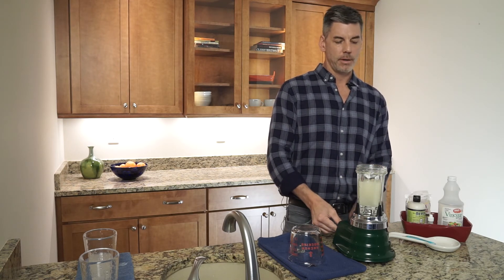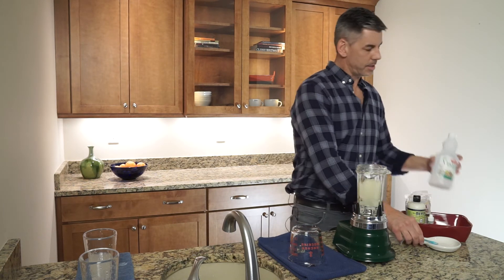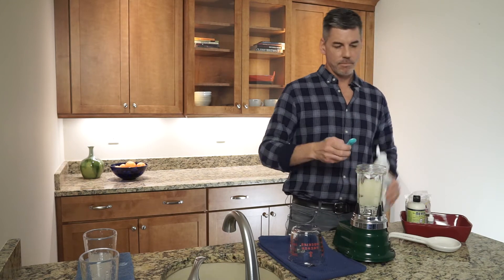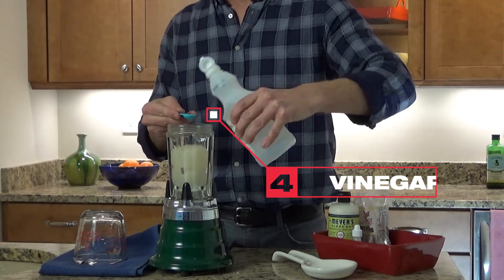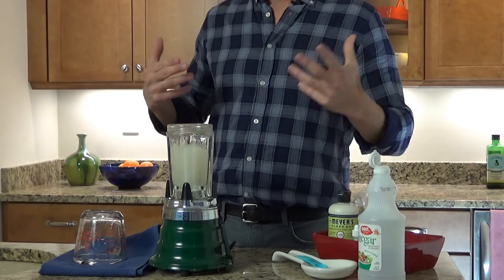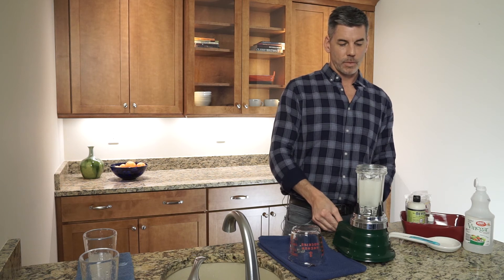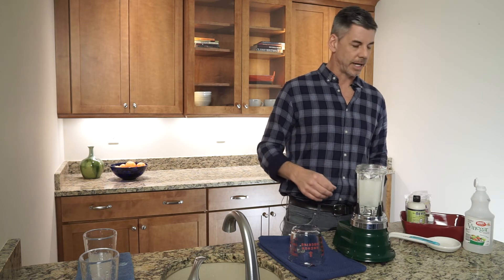The way we do that is to add our vinegar. We're just going to add another half teaspoon of this, and this will lower the pH and make the fluid thin again. When the fluid gets thin, it allows the oil and gas to come back out or penetrate through the fluid and back up to the surface, leaving the sand to prop open the fractures.